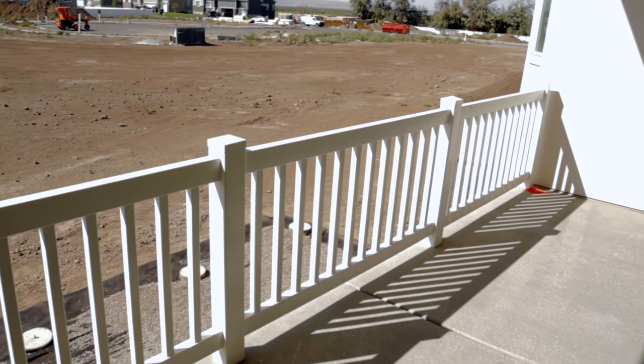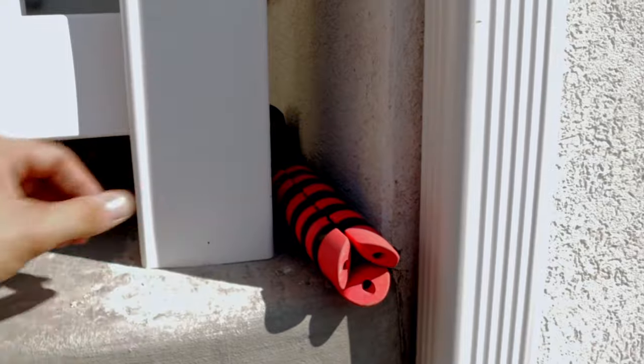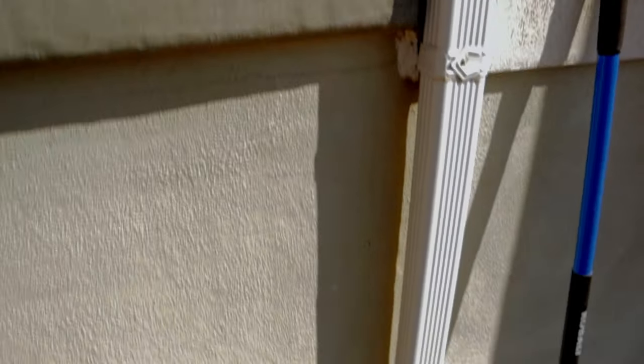The other half of the load is going to be placed on the concrete patio. For this specific installation, the builder put in this PVC railing. The posts on the railing were installed using pressure bolts that I'm going to reuse. These four posts are in a perfect location to mount my beam, and what's also nice is that it's directly above the foundation wall, which will effectively take the load of the deck.